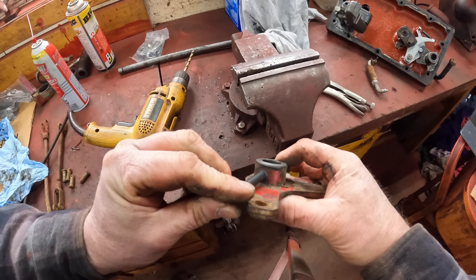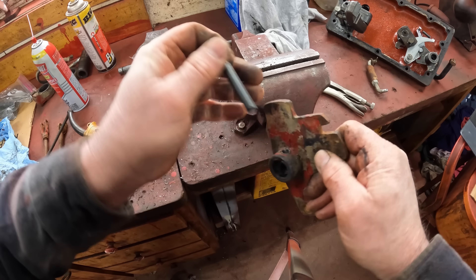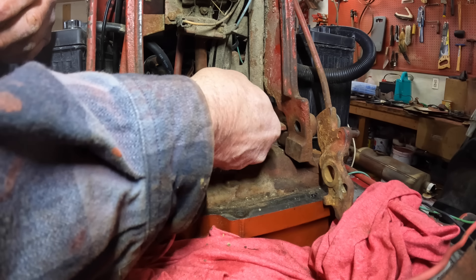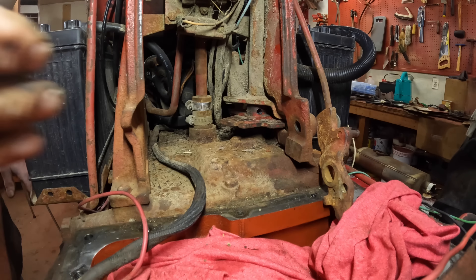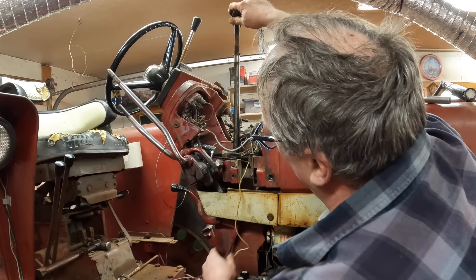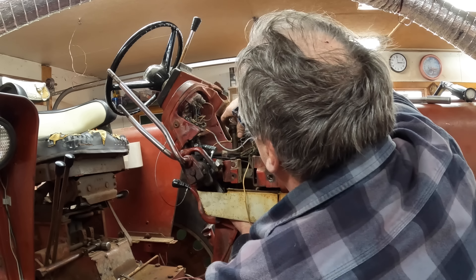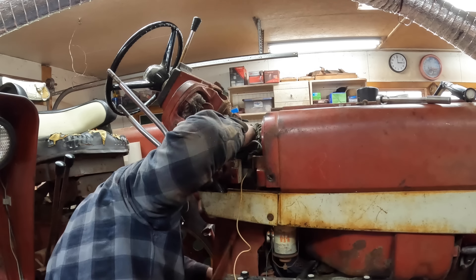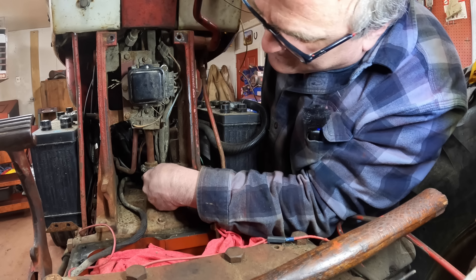We're just going to send the 5/16-inch drill right down through here. Now we have round holes here that are tight to the spring pin, and round holes here that are tight to the spring pin. We'll set this back in place, slide the shaft back down to its home. I greased it up a little bit — that'll make it work well, hopefully. There we go. Absolutely no play now. Well, it's worth the time.